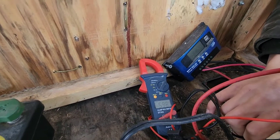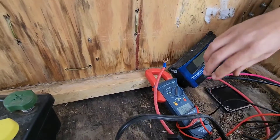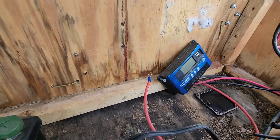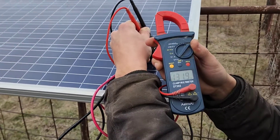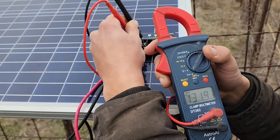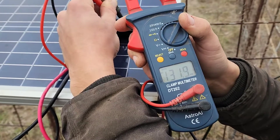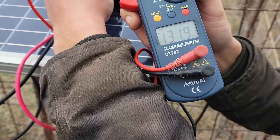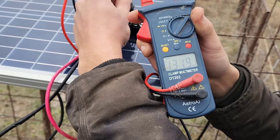This is a cheaper controller — it's not the kind we use anymore. We'll show you the ones we've switched to that we have less problems with, but they're not foolproof. So now we've brought the new controller out here, hooked it up just to the panel. You can see it's saying 131.9 millivolts, but that's actually 13.19 volts. And that's what it should be coming out to your battery.